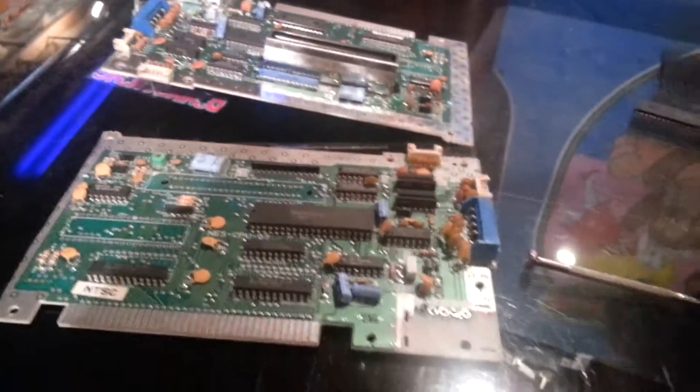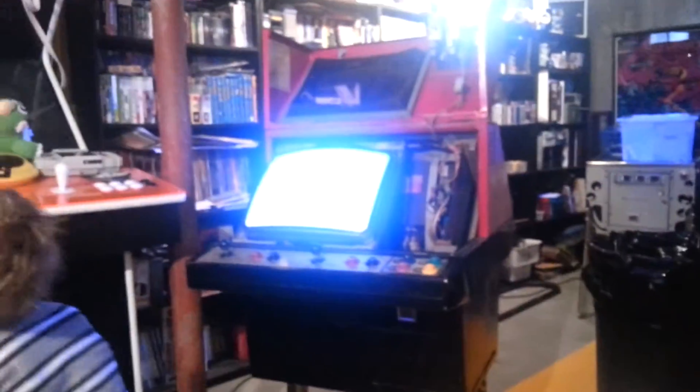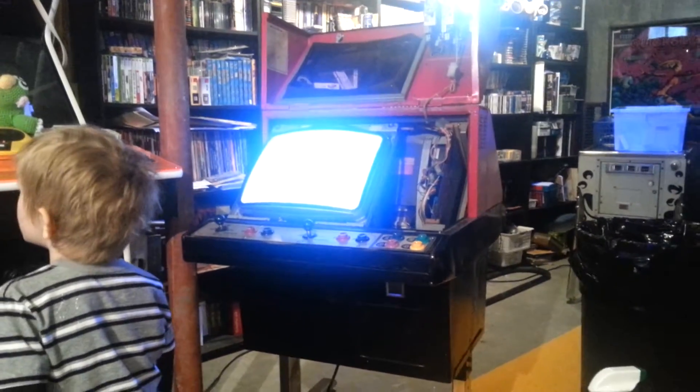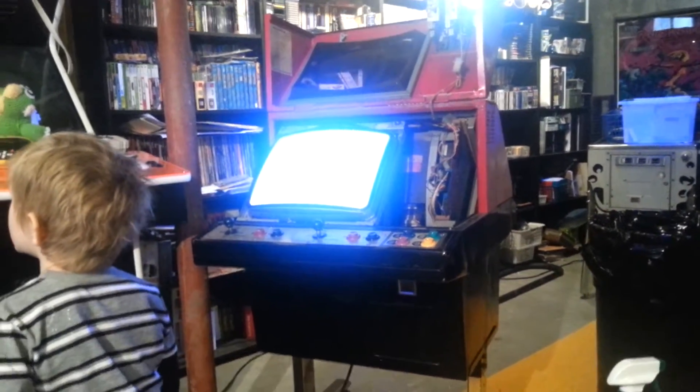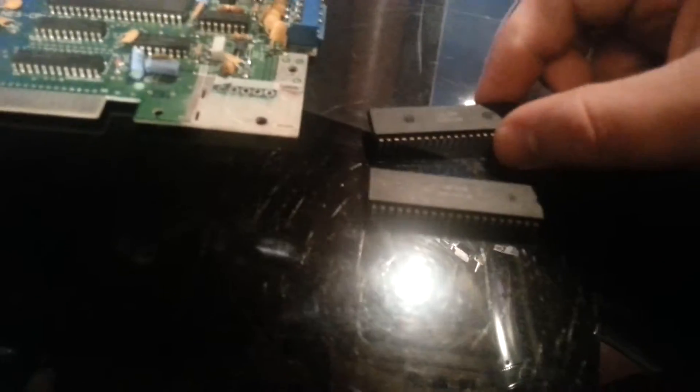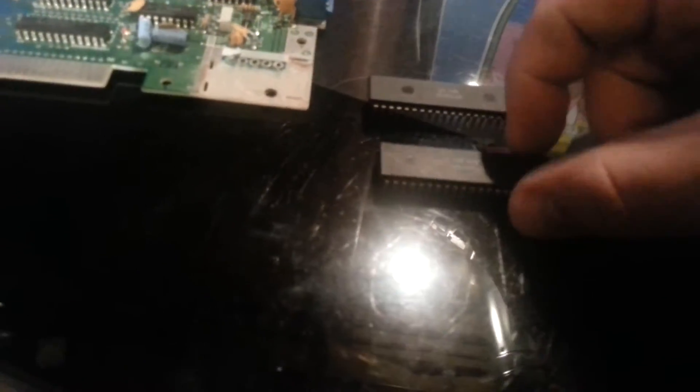The reason I'm doing this is you're probably familiar that I have a Nintendo Versus Dual System — it's a Nintendo Red Tent, what many people call it. There's my son Edgar there. In those, there are essentially two NES systems on one board, and you have a Nintendo processor and a PPU unit. The PPU unit is a special RGB one, and each one is different for each game. But the CPU in it is the standard — the RP2A03.